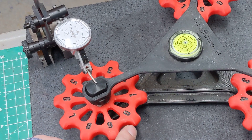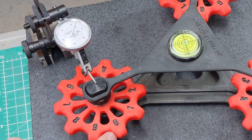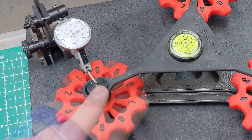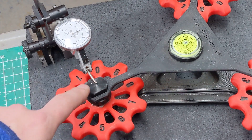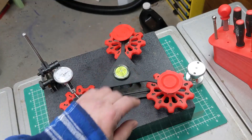The knob is graduated with ten numbers, meaning each graduation is approximately a thousandth of an inch. I hate to call it a thousandth since the difference is metric and there's a fair amount of error across the entire travel, but with the five tenths indicator out it's easier to talk about. As you can see, moving one graduation gives you about a thousandth of movement — it's very fine adjustment. The downside is that means the whole mechanism has a very limited range, with each leg only being able to move about a sixteenth of an inch.